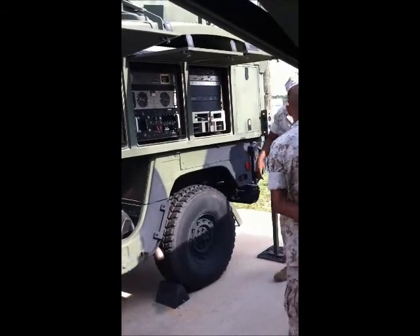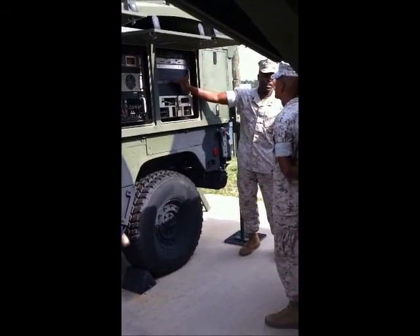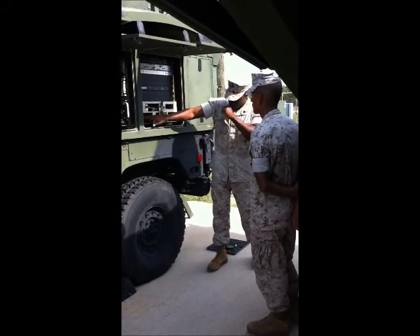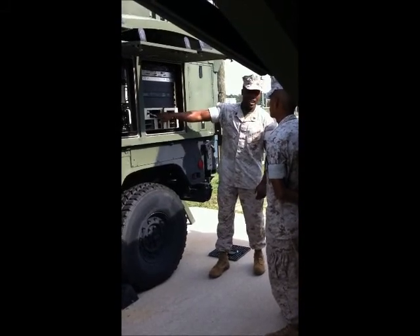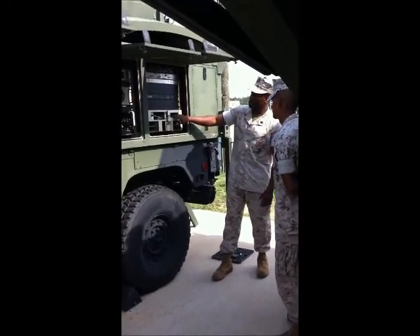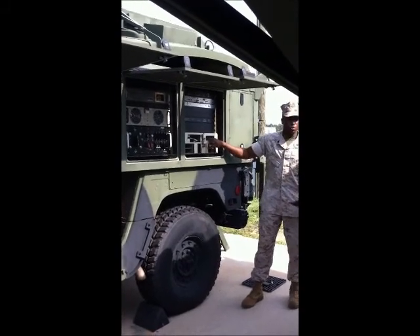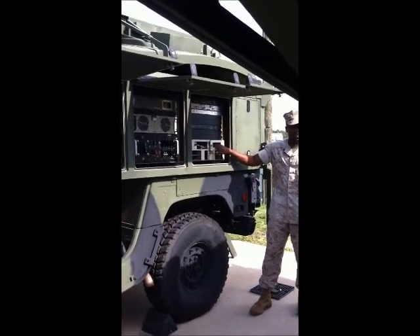Let's move over to bay 6. In bay 6, you have the ultimate controller, your binary frequency system, CVMCU-2 or your fiber optic modem. And then you have the actual crypto cages — you can't have any crypto loose; keep it locked away. You have four slots for your KIV-19s and a slot for your KY-99 voice encryption. KIV-19 is for transmission encryption. Last but not least, you have a slot for your actual CYZ10 — a DTD or data transfer device — for key loading. You can also utilize SKL; SKL and CYZ10 can both be utilized.